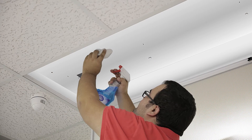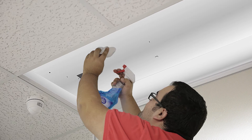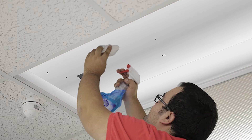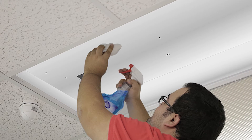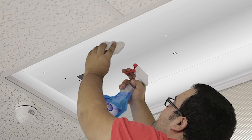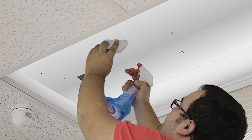After removing your old fluorescent light system, start by cleaning the troffer with a glass cleaner like Windex, and then rubbing alcohol to remove any dirt, adhesives, or grease left by the old fluorescent lights. This step is important because an unclean or dirty troffer will prevent the LED strips and power supply from adhering correctly, and they will lose adhesion due to heat over time.